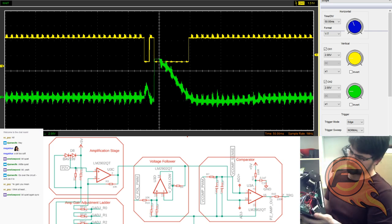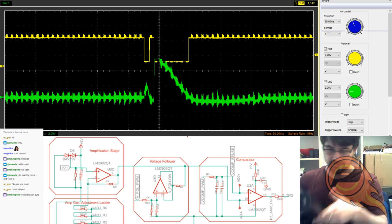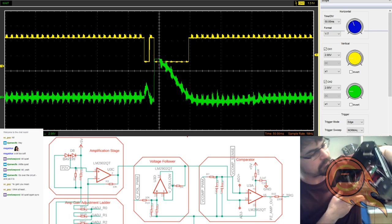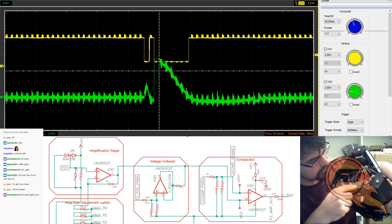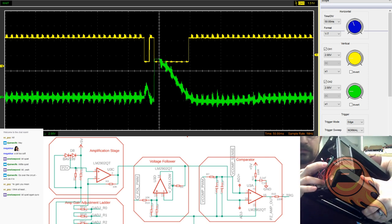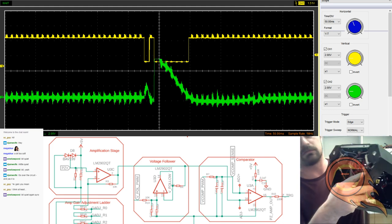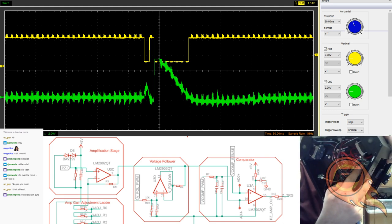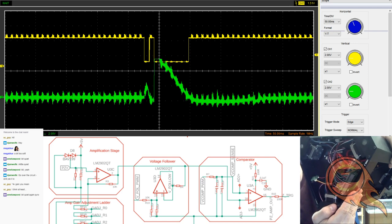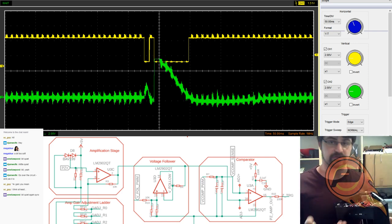This thing was pretty easy to mod to get my sensor to work with it. Besides adding those piezo discs, all I had to do was take out the original little 3-pin connectors for those buttons and add mine in right there. Easy peasy. They're all tied together using the same exact sensor pin. They're not individual, so I could have hooked them up to any one of them at all.